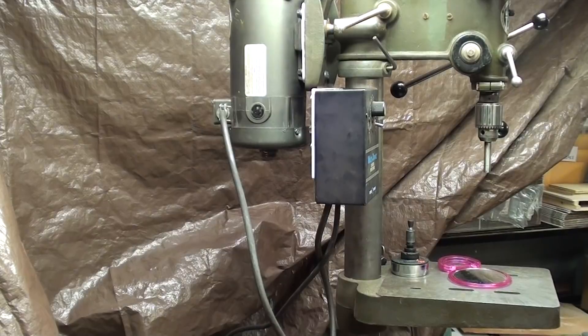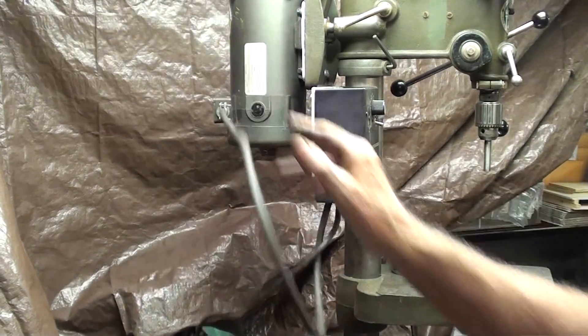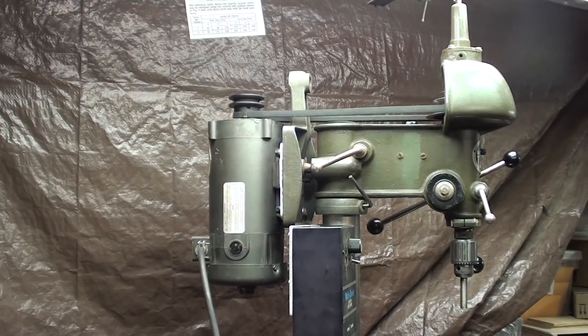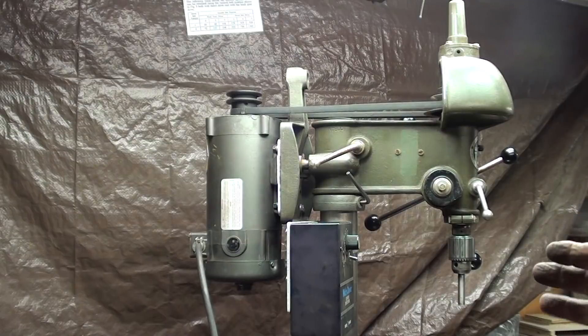Should you work on motors and wiring, make sure the power is off — I always like to give a safety warning. This is a grounded three-wire system with plenty of cord between the motor and the box — maybe too much, but I can wrap that up with a wire tie. In the next video I'm going to drill some larger holes — we're talking 5/8 and 3/4 size in steel — to see if the speed is okay and if the torque is okay. Will I stall it out? That's the purpose of the following video. And then yet one later video will be strictly hole saws — I want a speed slow enough for large hole saws. The doubting Thomases have said this won't work at really slow speed, which is why I'm talking so much about belts and ratios.